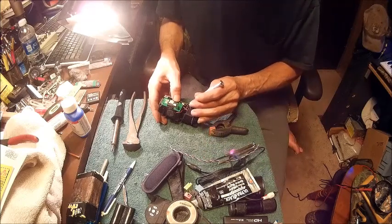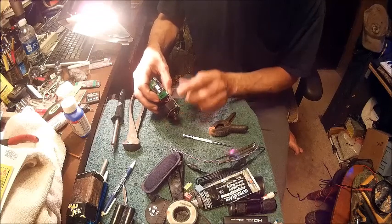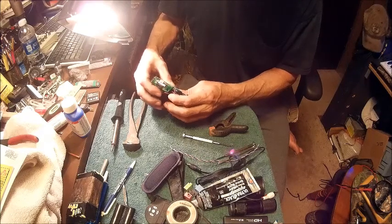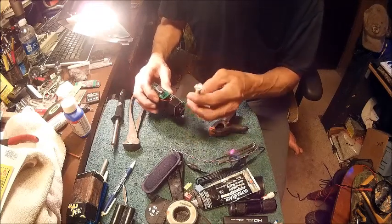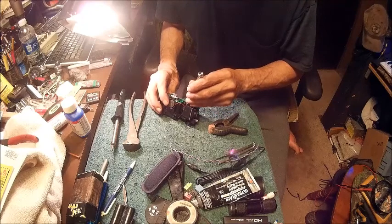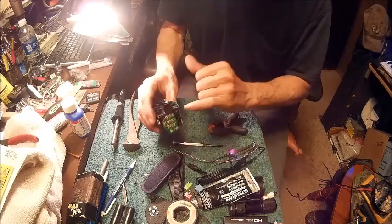And we're just going to push them wires down underneath that and make them so that they're not on top of each other. And then get it to where the plug is plugging up. So you've got the plug for the zoom, and then you've got the plug over here for the lens. So we're going to plug the lens in, and then we're going to plug that in, and if you notice, it's a little hard to go in there, so that means that this wire is being pinched. So you want to make sure that wire is not being pinched. And if it's pinched, if it doesn't move freely, like it is right now, it's moving freely, it's not pinched, and we've got our plug in place.